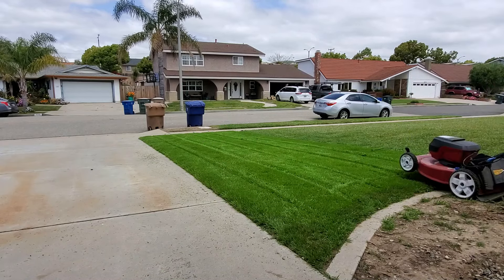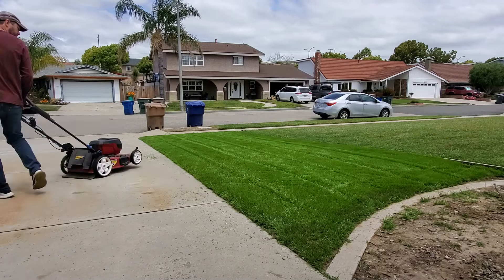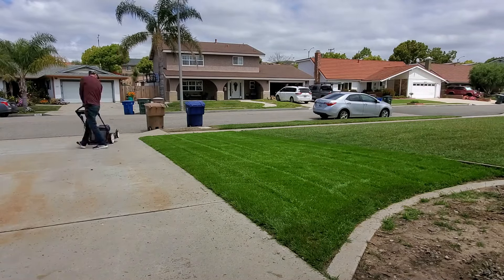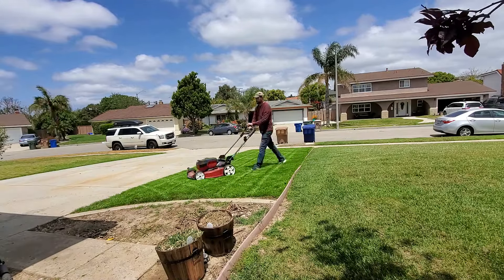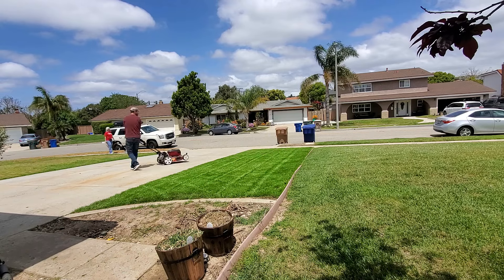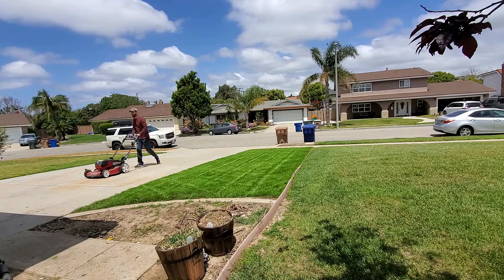If you were to increase your cost and buy a second or third piece of rebar, every 36-inch piece cut in half and strapped to the back of that flap adds two pounds of weight. If I were to do this for all of my lawnmowers, I would flip them over and make sure that any extra material I'm adding to that flap isn't in danger of going under the mower and getting anywhere close to those blades.